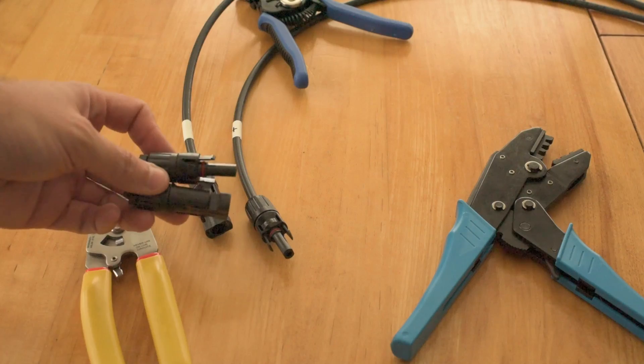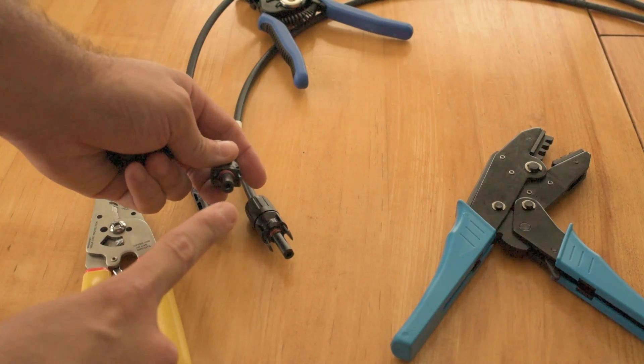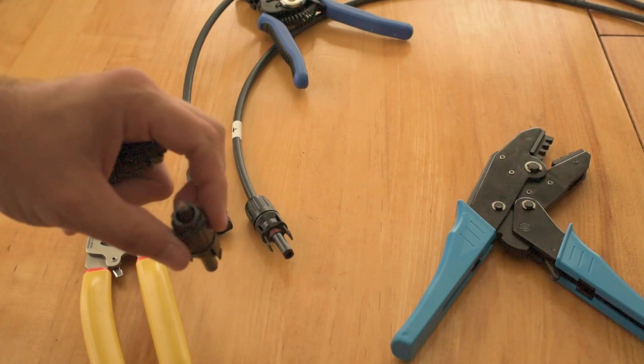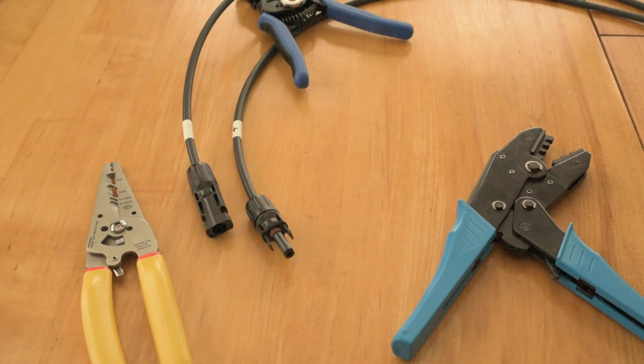Now these two connectors aren't really reusable. You could theoretically reuse them — I've actually yanked the metal part out with the cable still attached — but I don't think you're supposed to do that and I wouldn't recommend it. So the old ones are just junk; throw them out. And that's it, that's how to wire MC4 cables. Pretty simple standard stuff — I think anybody could do it. It does require a little bit of hand strength to use that crimp tool, but you can use two hands, that helps. This is Jesse with Create This. If you found that useful, please subscribe. Thanks for watching.